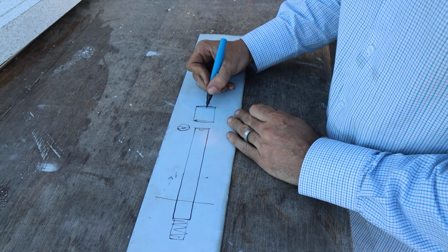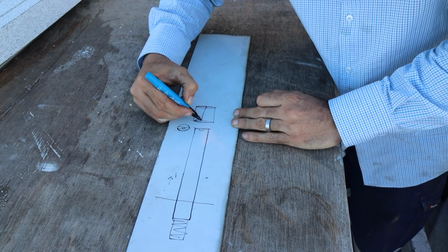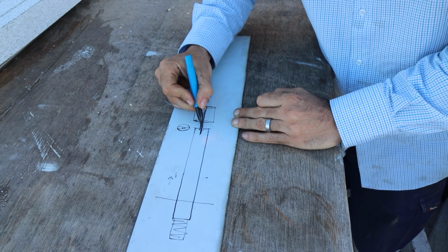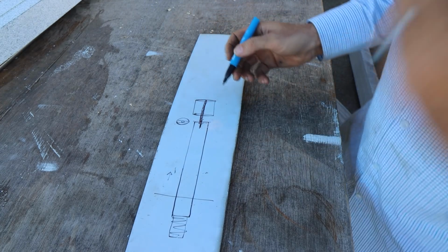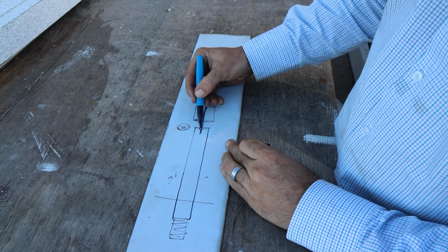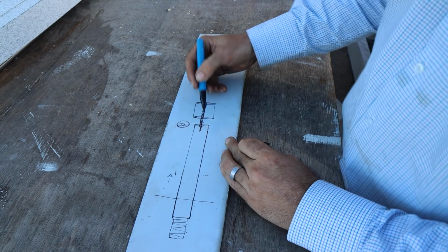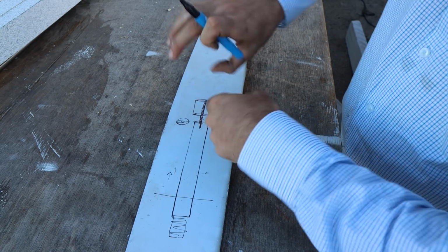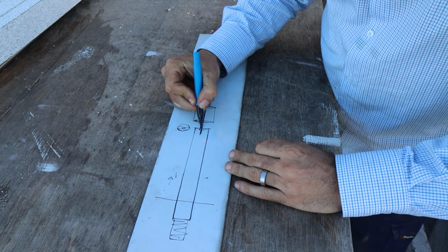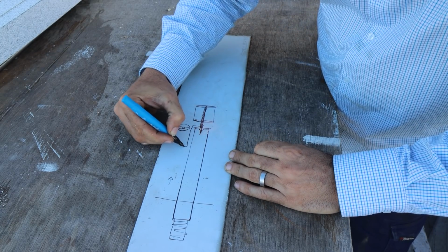And then on the center here we weld a piece of threaded rod, which just comes down and goes through that nut there. This screws all the way down so that that surface there touches that surface there, and you have a rubber gasket on it to seal it all off. Then when you want to crack it open, you just undo it. You only have to undo it half a dozen turns, and even when it's in its open position, it sits down like this.